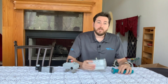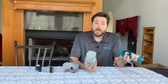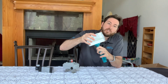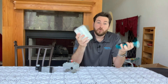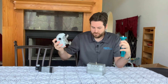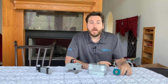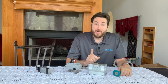The first part is sizing the actuator to the butterfly valve. The most common adapter you're going to need is called a reducing sleeve. Because as you can see in this instance, there's a lot of play here. That's because you need these dimensions to be the same. So all we're going to need to do is take our reducing sleeve... Where the heck? I need to go find the reducing sleeve. I'll be right back.